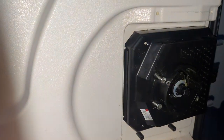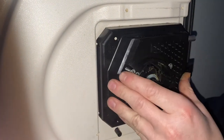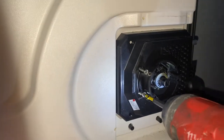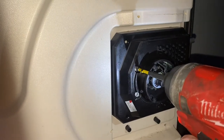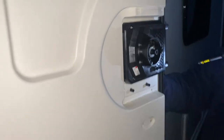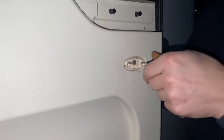It would have been better to have started with all the screws out, just to make sure they line up properly. They don't need to be over tightened — ideally use a manual screwdriver, just nipped up. Test the mechanism — the door handle works okay. The two long screws at the bottom are a bit more of a fiddle because you've got to try and centralise the plastic housing to make sure you're not going straight into the foam insulation inside the door at an angle.